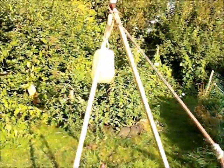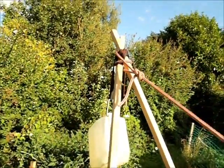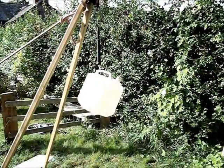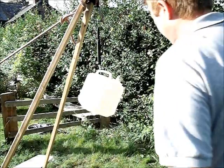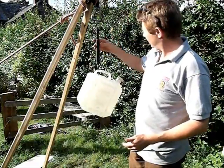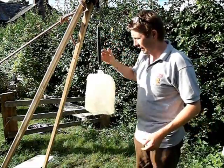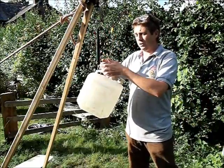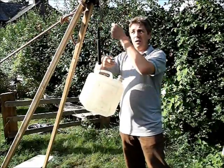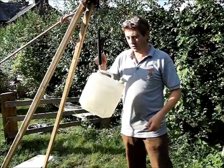I'm just going to play with something on a pulley and have a look at lifting weights and the strains on that top point. I've knocked half the water out so this is now reading five kilograms — eleven pounds. So if this was a machine and you're using a chain hoist from here to here, just drawing it up, that's what it would weigh and that would be the force on the top hook.